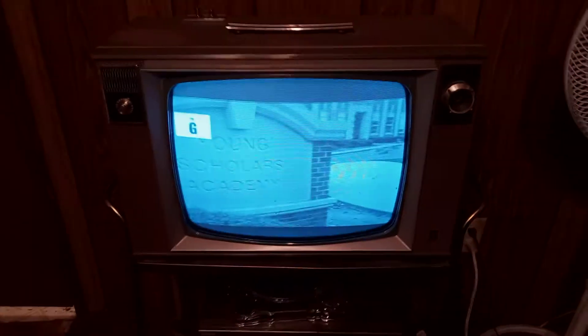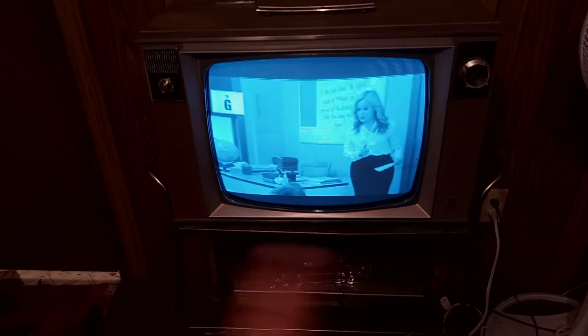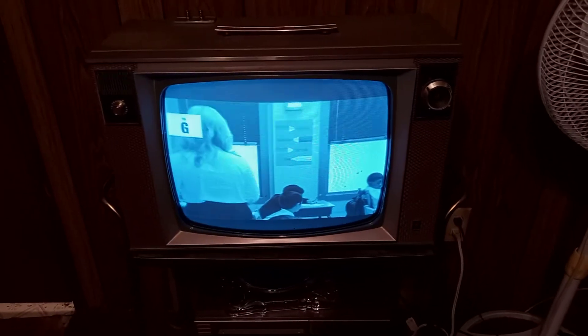There's the Zenith television and we'll have to do a part two video — we'll take it apart and see if we can get a proper diagnosis. I'm pretty positive it's probably got a bad integrator, or there might be a resistor in the circuit that may have changed value. Thanks for watching this video, stay tuned for the part two.